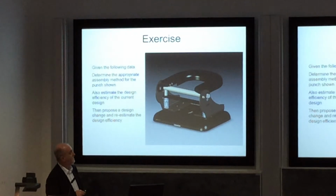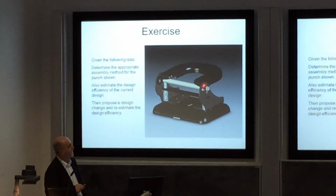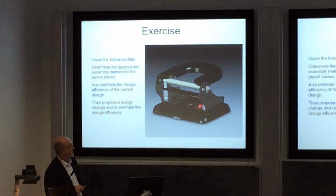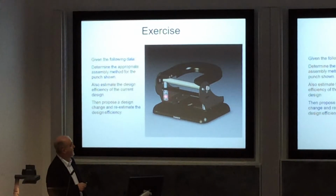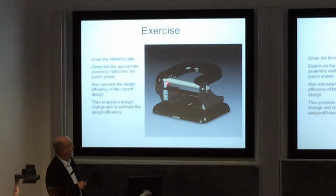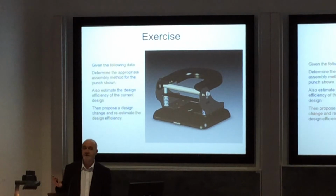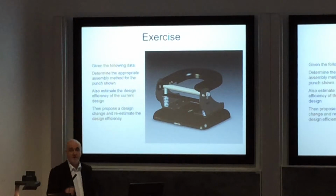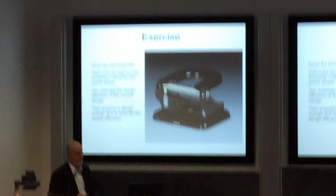These are formed from sheet metal parts here, the handle. This is just a metal bar, metal side plate, riveted to a metal base, which also has a metal cover that you can unclip and take the parts out. So very simple. Spring here to offer resistance to the load and punching, and these come down and punch through the two holes. It's a very simple device, but quite old-fashioned in its design. That's deliberate, so you can see how we can improve it.